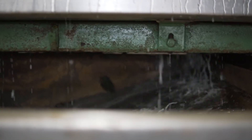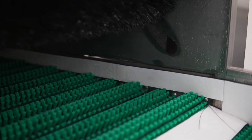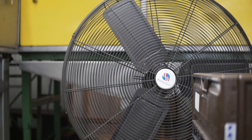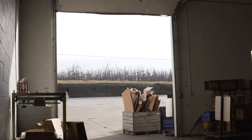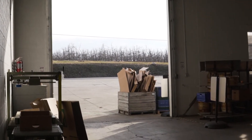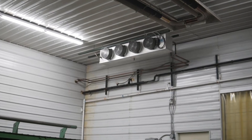Drying is an essential step to the cleaning process. Without adequate drying, the excess water and moisture could encourage bacterial growth. Fans or blowers that are designed to dry floors and carpets are excellent tools for areas of equipment that are difficult to dry. The packing area should have plenty of ventilation to help reduce humidity and bring in dry air. Areas around and outside of the packing area should not be forgotten, as bacteria thrive in high areas of moisture, so standing water or condensation should be reduced.